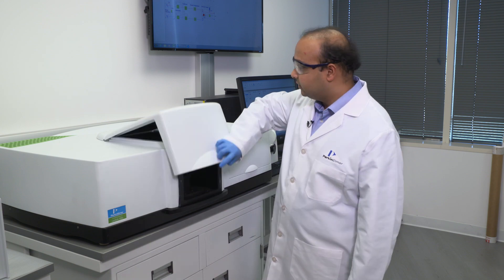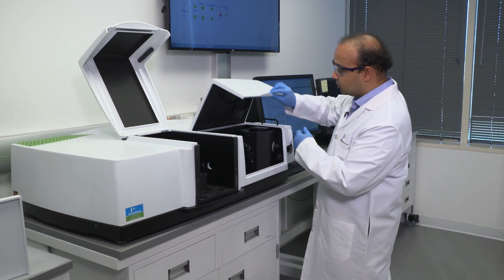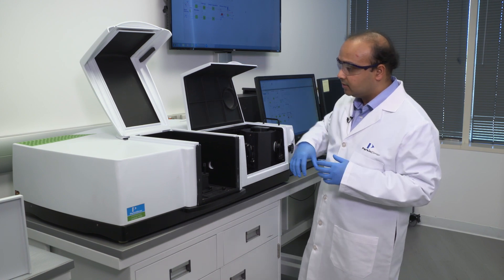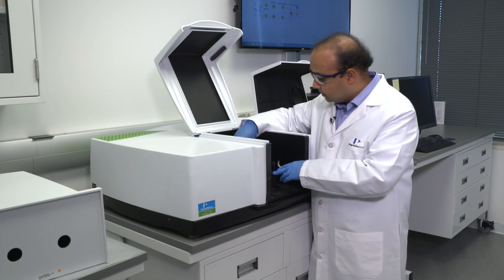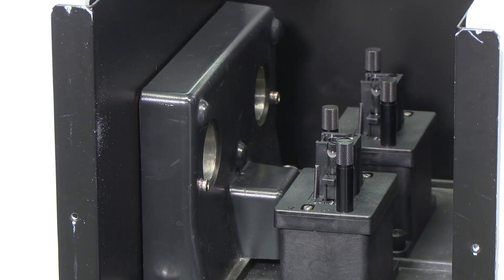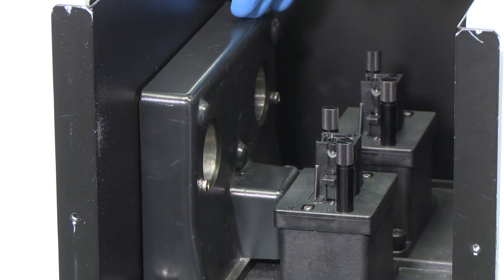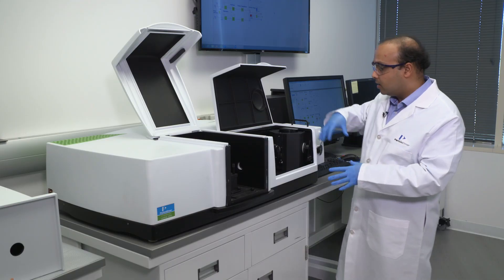On the Lambda 1050, there are usually two parts to draw your attention to. This is a modular arrangement. The sample compartment here has two cuvette holders — standard 10 millimeter liquid cuvette holders capable of measuring absorbance through the sample, as well as a polarizer drive capable of measuring angular polarization of optical samples.